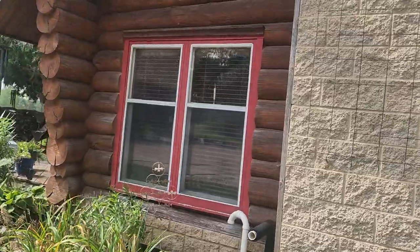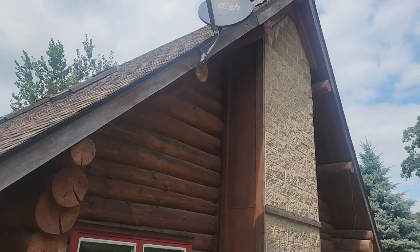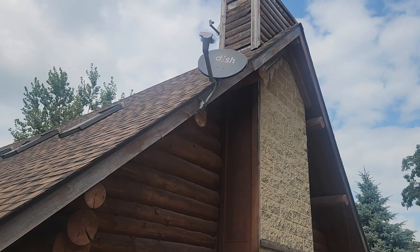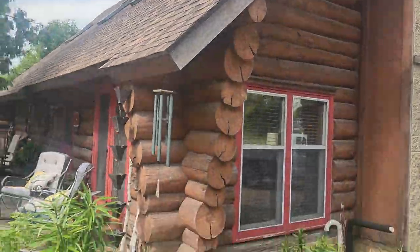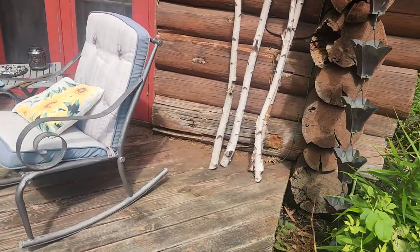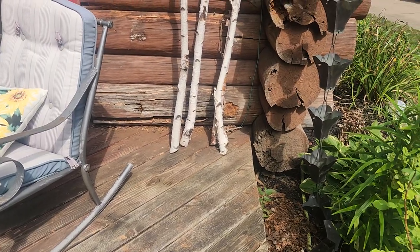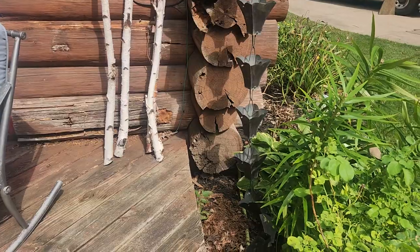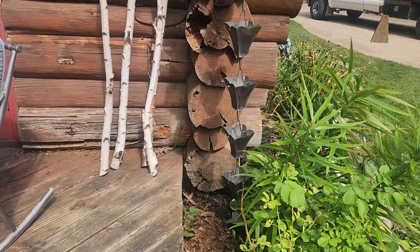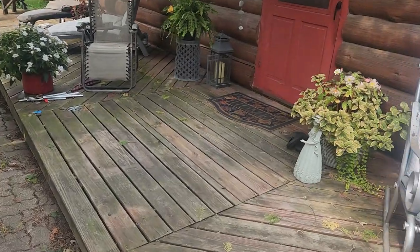The other thing that needs a little work here is their chimney chase. This has got log siding on it up there and it's in really bad shape — it hasn't been stained in years. The other area is this spot here which is getting a fair amount of splash back from the roof, so we've got to re-face that bottom log, which is a 14 inch log. And then we've got three crowns over here on this side that have suffered as well. That's it for log replacement.